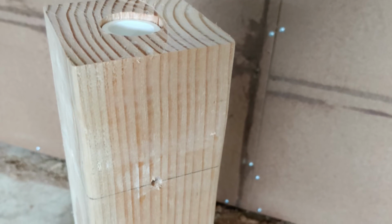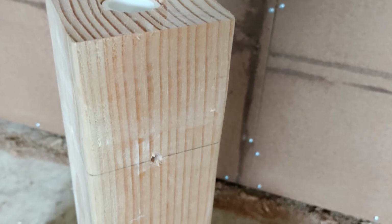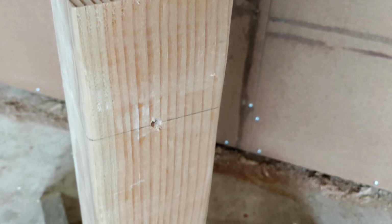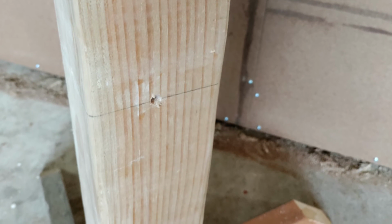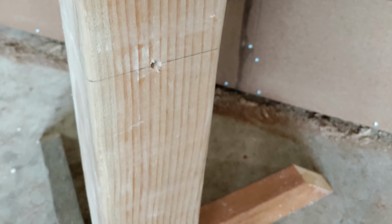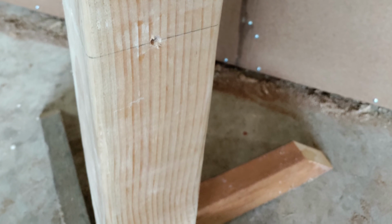What I'll be doing before I actually cut with it is just lifting the PVC out, putting a small strip of wood in the bottom there for it to sit on top of, then dropping the PVC back in place. That'll lift the PVC up so that as the water accumulates from the tatami draining down, it'll leak down, get into that little circular ring on the outside that I used from the hole saw, and then it'll drain right out of those little drainage holes. Thank you, gravity.